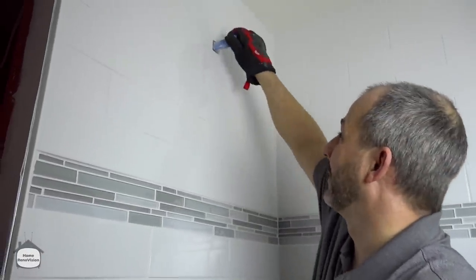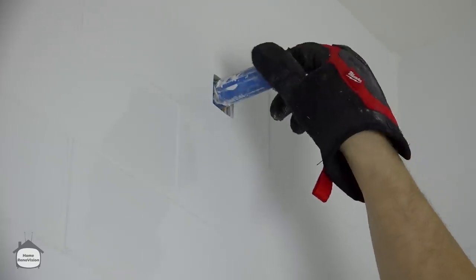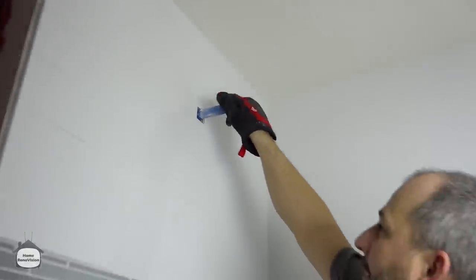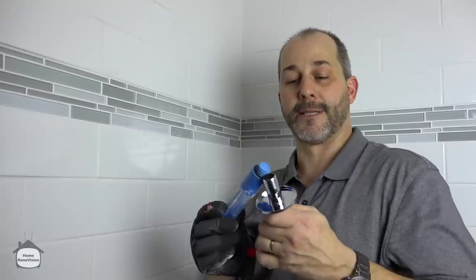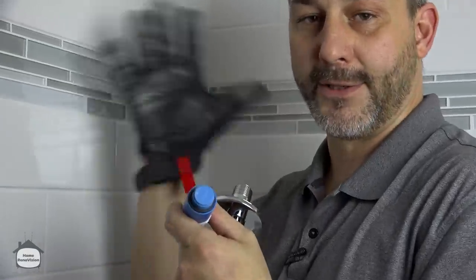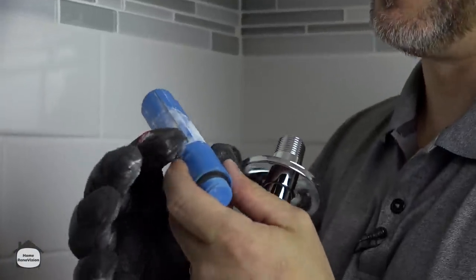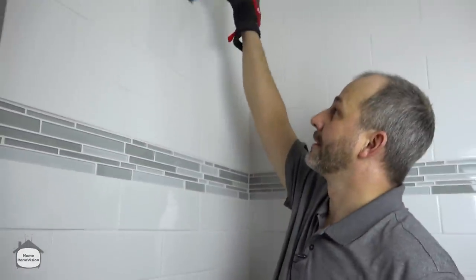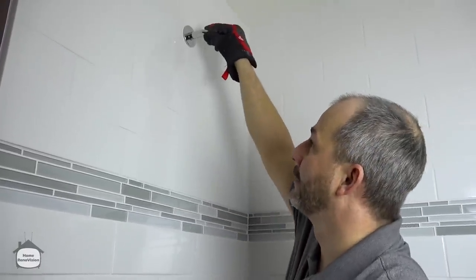Hopefully I don't get soaking wet. If you haven't seen the project video and aren't familiar with these — I buy them at my specialty plumbing store. It's the same size as this pipe but has a little gasket on it, so these are temporary fittings I put in there — a shutoff system. It's also an identification system for installing wallboard and tile: it's exactly the same dimension as my pipe, so when I install this I know exactly how to make my cuts, and these tiny flanges that come with them cover that hole perfectly.